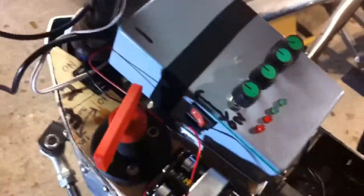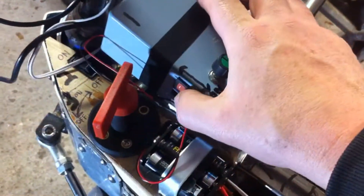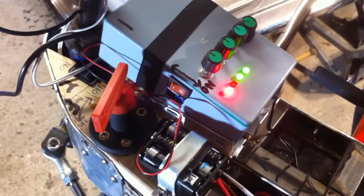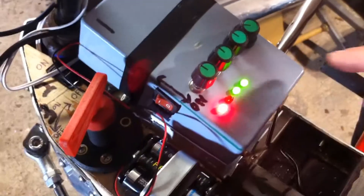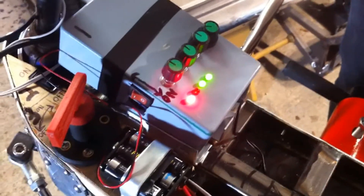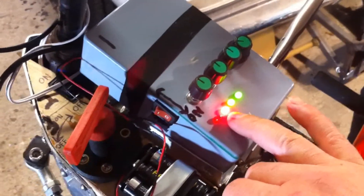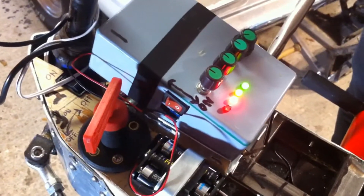Here's Nick assisting me, pretending to be Steve Jobs. So what order do we do things? We turn on the brain of the Kelly controller, turn on the Arduino — it's tilted back slightly, simulating the normal start position. We wait for it to be ready: when these two lights are lit it means it's putting out a signal of 2.5 volts, which means nothing should happen when we turn on the Kelly controller proper. This light shows it's booted up and it's waiting for me to bring the IMU level, at which point the machine will start.